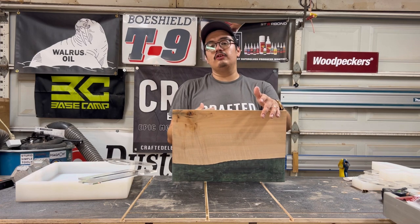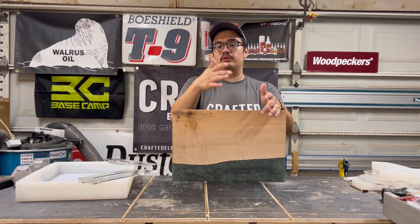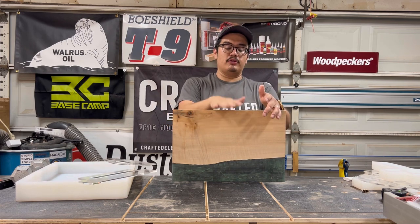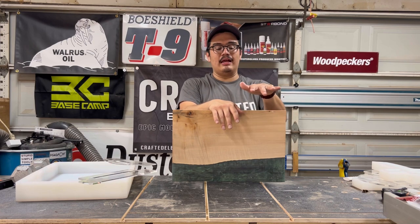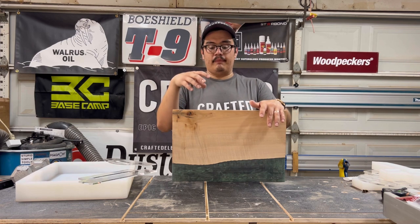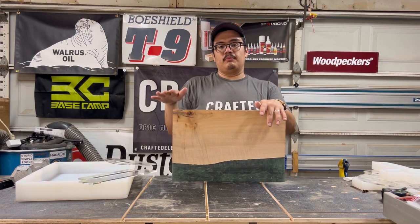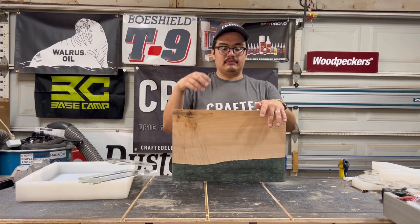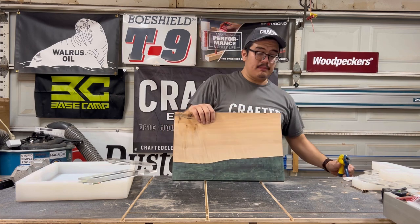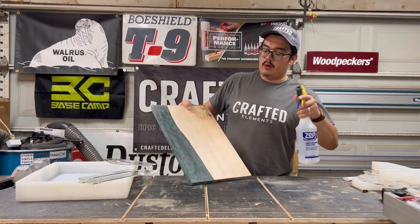So what I like to use for my boards is walrus oil. Depending, I'll use furniture butter for some, I'll use their furniture finish, but for charcuterie boards and anything that has food on it, I will do their cutting board oil. So like I said, it leaves it porous enough to really soak in all that oil and then leaves it protected. And then I'll do a food safe wax, of course, after. So what I'm gonna do right here is I'm gonna take some isopropyl alcohol and I'm going to wet this board